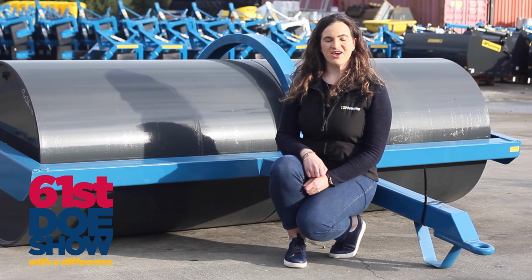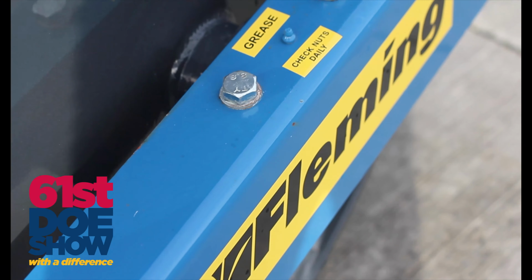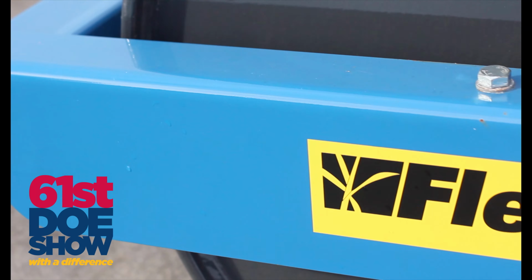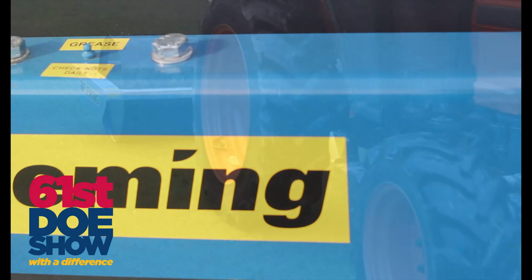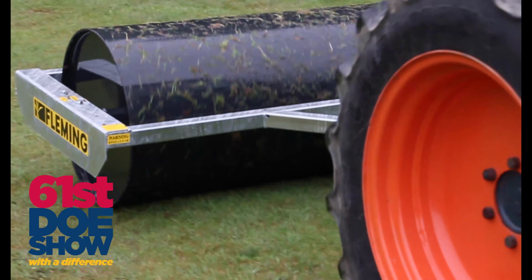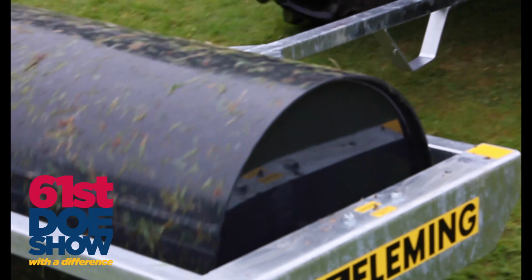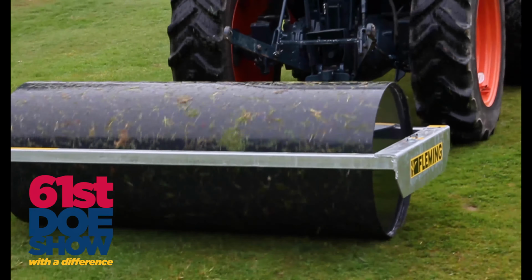Today we're going to take a look at our roller range. All Fleming Agri Land Rollers can be water filled and the drums are air tested as standard. They are all fitted with hardwood bearings. Compact rollers are available from 4 foot to 8 foot work widths, with 24 inch drum diameter and 6 millimeter plate.